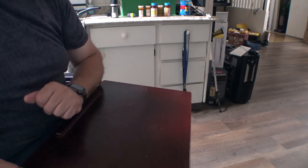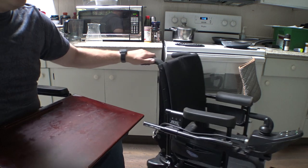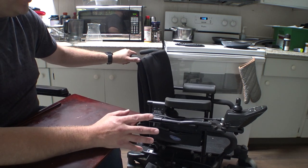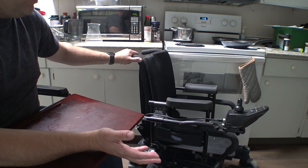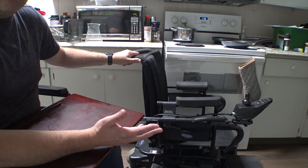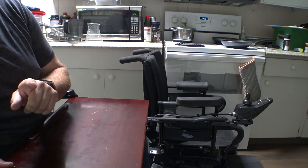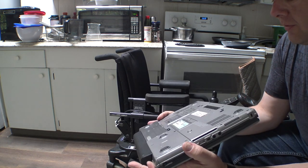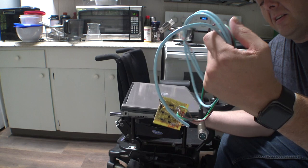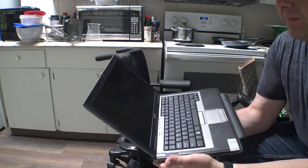The nice thing with this chair is it has gearbox neutrals instead of brake disconnects, so it's very easy to push around when it's in neutral. I don't know if I'm selling this thing yet, but I need to get it back to a normal program. Let me grab the laptop the software is on and see what happens. We've got this old Dell laptop — one of those old business ones — and the nice thing is it has a COM port on the back. I could potentially run a USB-to-COM port emulator, but for proof of concept I wanted to keep it strictly serial, since those USB emulators can present problems of their own.